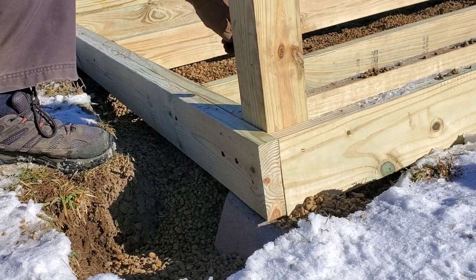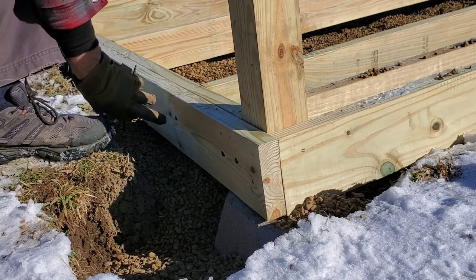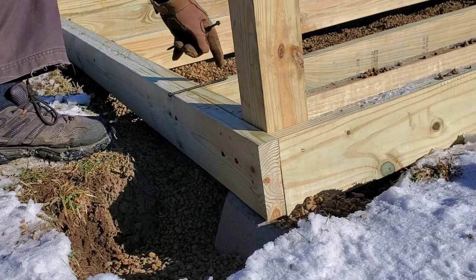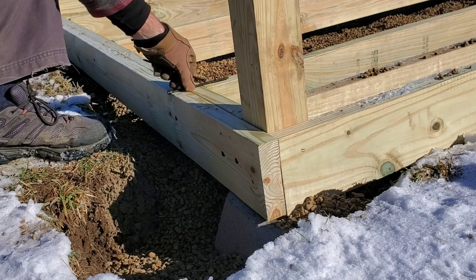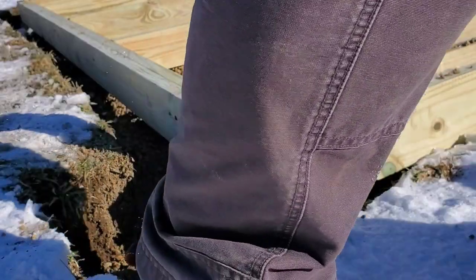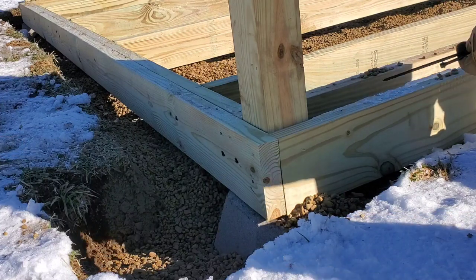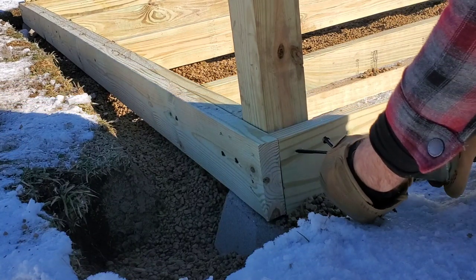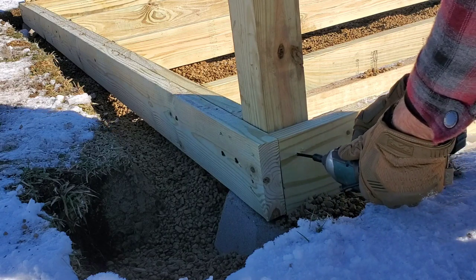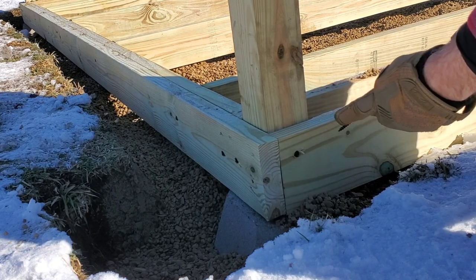All right, so now this backboard is really locked in. The board that has all the trusses nailed into it, I have that one locked in on the side over here. I'm gonna put 2 of the long 6 inches through here right now. It's gonna go through this and the back one. So it's really gonna tie everything together there. Plus, I put the 6 inches through here to even lock, pull that all nice and tight too. So this should be pretty secured. So this will go through both of these and it'll really tie it together. I'll put one over here. Down on the next diagonal.